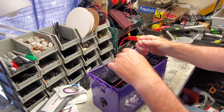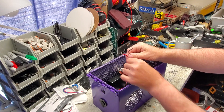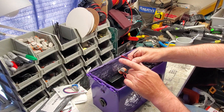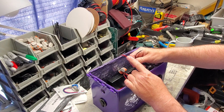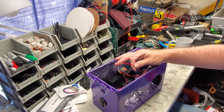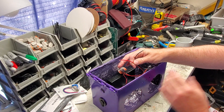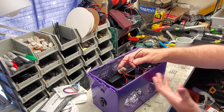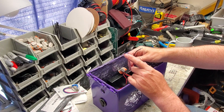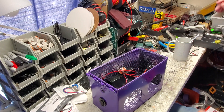This is our positive and negative coming from the battery. What you want to do is go ahead and put a fuse on the positive side, and then from the fuse you're going to run to your switch. On a battery this small you don't need an automotive relay in the middle of the circuit. If you were building a bigger box you'd have a bigger battery and a different setup, but for this setup you can run directly through the switch — just make sure you put a fuse on there first.